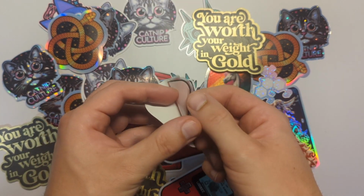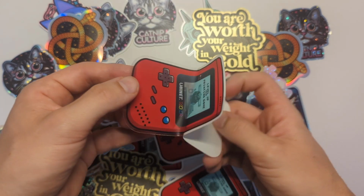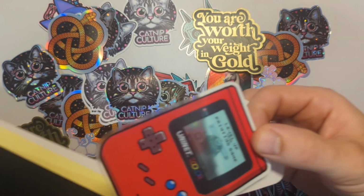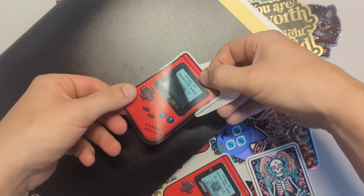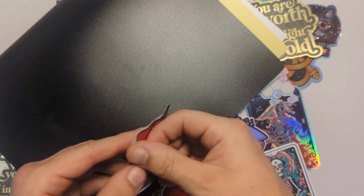white underprint. The white underprint helps us to keep the colors vibrant on a dark substrate. The display is purposely not printed with a white underprint, so you can see vibrant colors here in the red on the body, and the display itself has no white underprint, so it's translucent. Keep in mind that white underprint is only possible with an IColor 560 or IColor 650 printer.